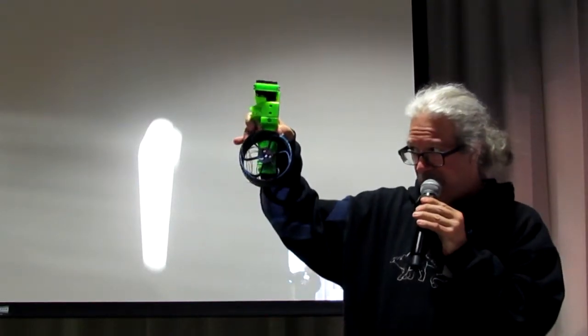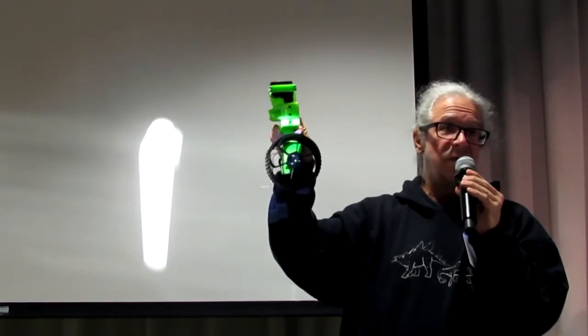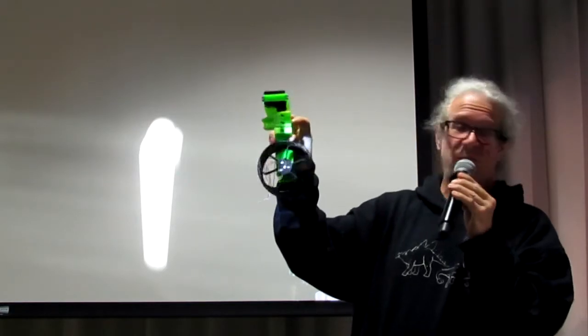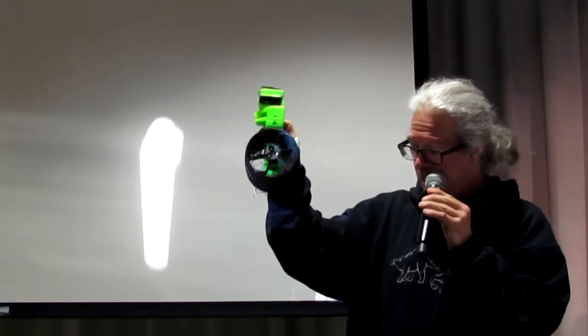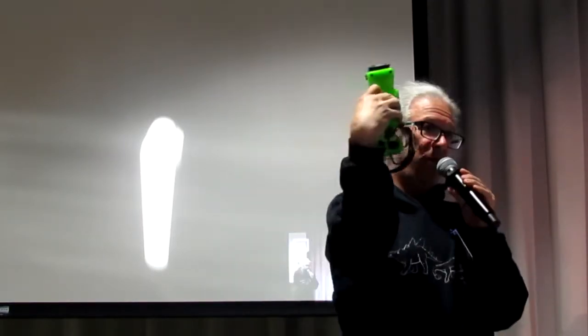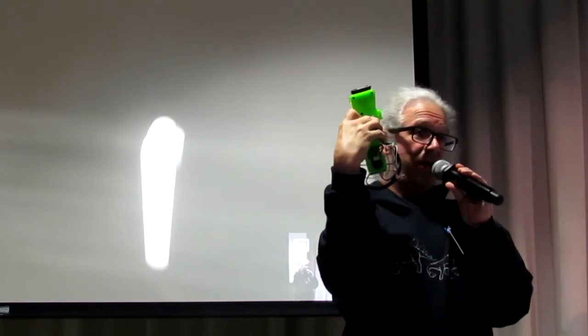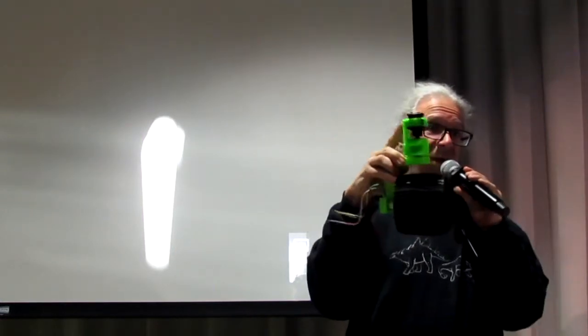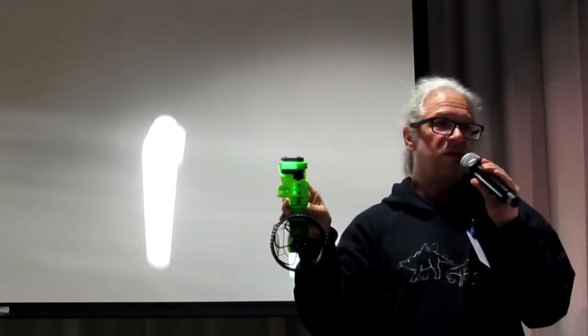This is carbon fiber PETG, the green stuff is PETG. The rotational shafts for the axles are carbon fiber nylon. And these are some cheap motors from Alibaba. And I've got a Dynamixel up here at the top. And it's all held together with heat inserts and M3 screws.